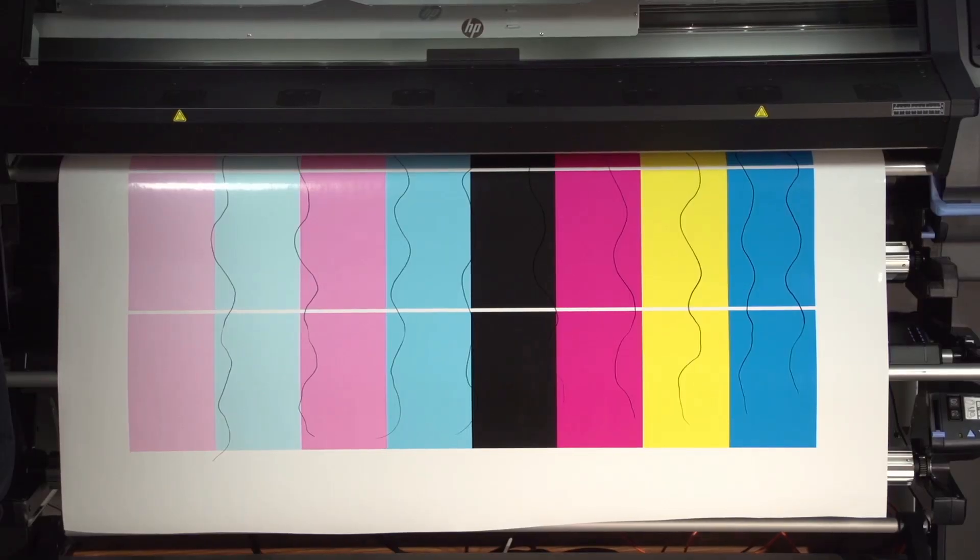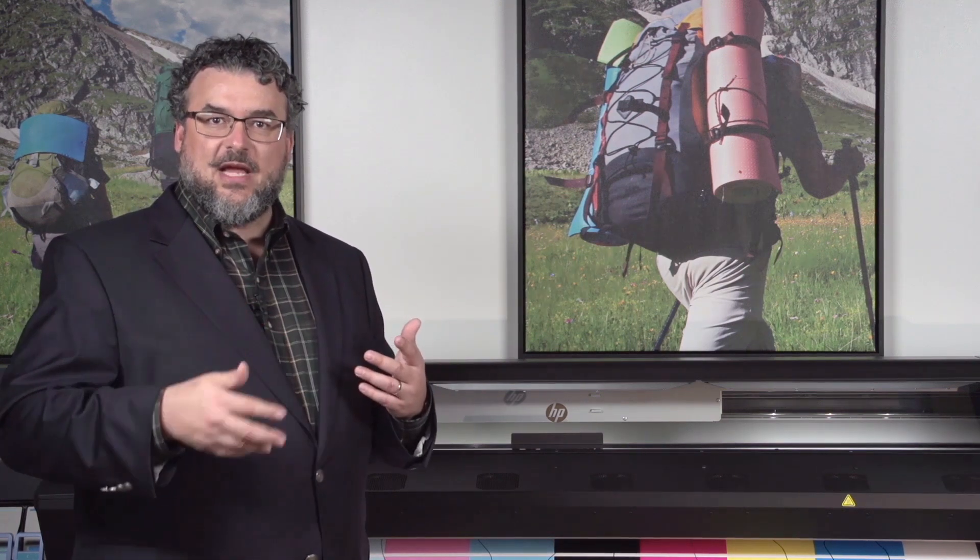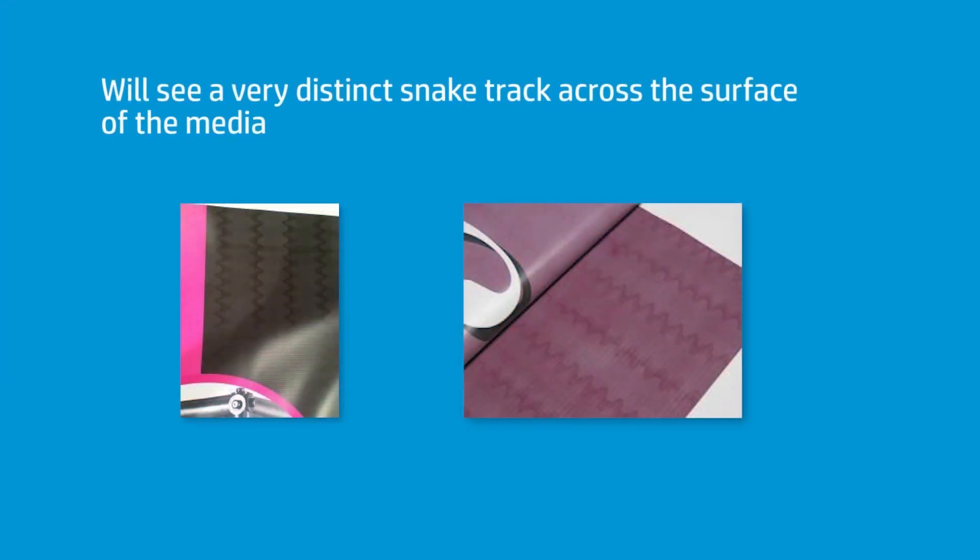If you load an old roll of material and see what I drew in here — I call them snake tracks. Snake tracking is what happens because HP has a very characteristic pinch roller, which creates a very unique pattern when it rolls over the media. We specifically design these pinch rollers for mechanical reasons to have the media convey through the printer well, but it leaves a telltale sign on bad plasticizer. You get a squiggly line that goes consistently, a bunch of them, all the way down the printer — it looks like the track of a snake going through water or sand. It is very unique to the HP Latex printers and it's almost a dead giveaway that you have a plasticizer problem.